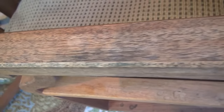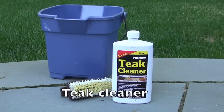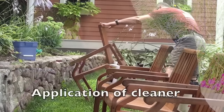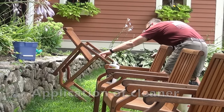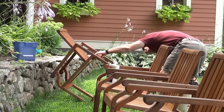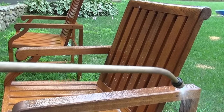In my situation, my teak had some dark black stains, so I went right to a commercial grade cleaner bought at the store. When applying a cleaning solution, use either a spray bottle or a garden sprayer. I recommend a garden sprayer because it requires less effort and evenly distributes the solution. Do this in a well-ventilated area, spray the furniture completely to get it wet, and allow the solution to soak in for 15 minutes, following the manufacturer's directions.